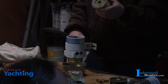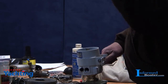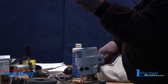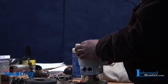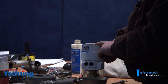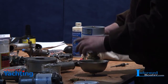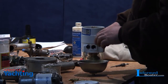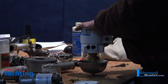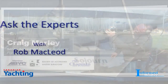Take your new filter - they come in 30, 10, and 2 microns. For powerboat use I'd go to 10 microns, but for sailboat use go to 2 microns. This filter has the capacity to pass 60 gallons per hour, and we'd be lucky to do a gallon per hour on a sailboat, so even a 2-micron filter will be a long time before it gets plugged. Sit it down in there. You've got to top the filter up since there's air in it now. If you have a jug of fuel on board you can fill it right up and put the lid on. If this filter is lower than the tank, open the tank valve and wait for it to fill by gravity, then tighten the lid down. You have to get the air out.